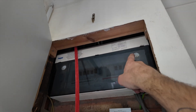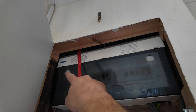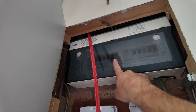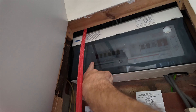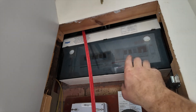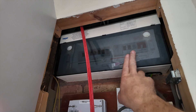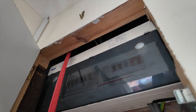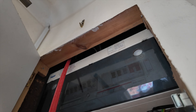This is the original board we've got to work with today — it's going to be changed. We've got a split load board with a single RCD protecting one side. We're going to come into here. There's the main switch and these are non-protected on the RCD. Lou's just put the cable tongue up and I think he's tied on.